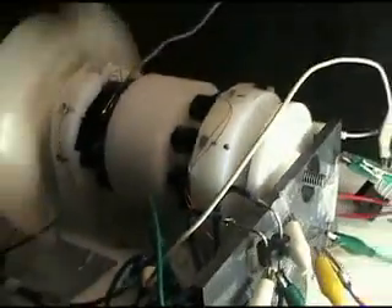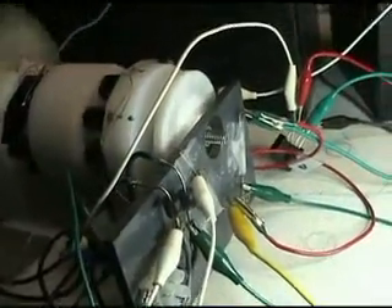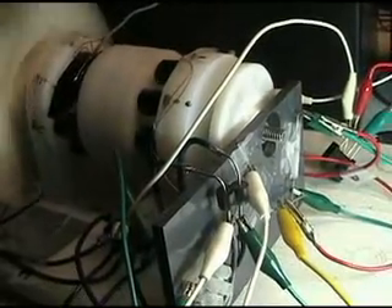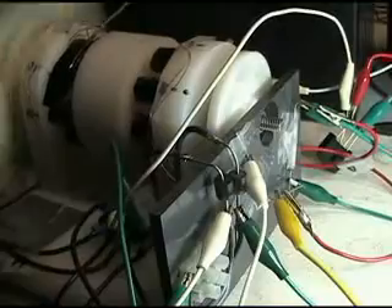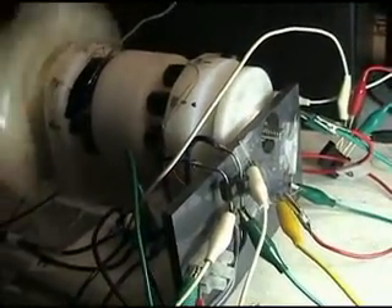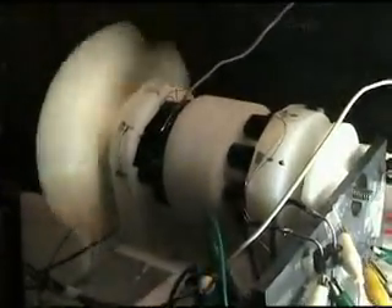The back EMF is being recirculated back into the system. And it's pulsing at 140 Hz. So that's 280 times it's being cycled back into the system — 280 cycles per second this thing is firing at it. So that's quite good, probably not too bad considering.